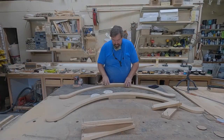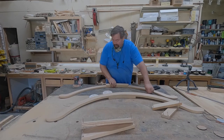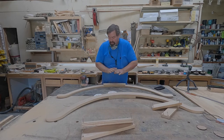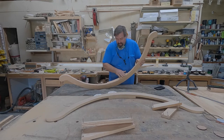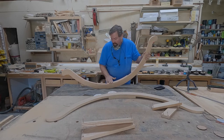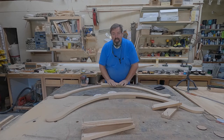Now that our belt sanding is done, we can bring it over here. I pulled out my sanding mat here, and I have 80 grit in my palm sander. So now I'm just gonna start going over everything with 80 grit, to smooth it out. And especially on this cherry, this is gonna sand really, really quick. This won't take long at all. And then we'll switch over to 120. We'll give it a final sand, and then we can start putting this all back together.